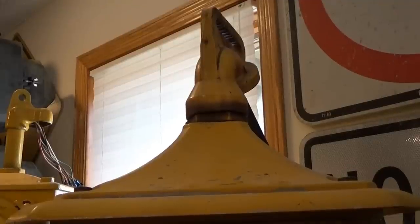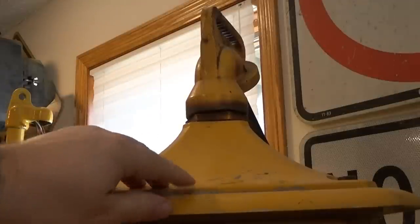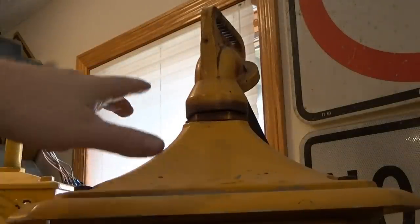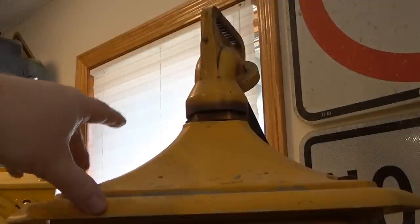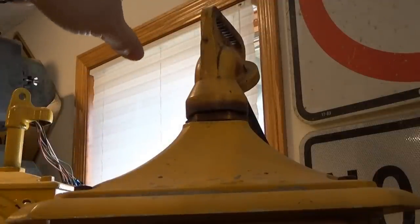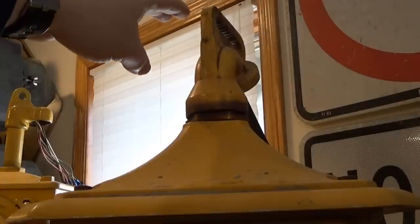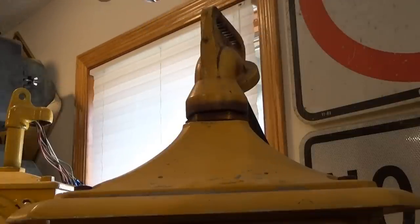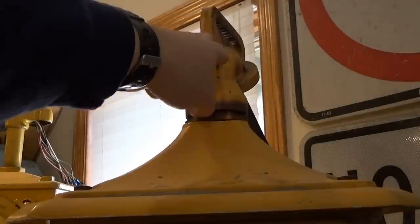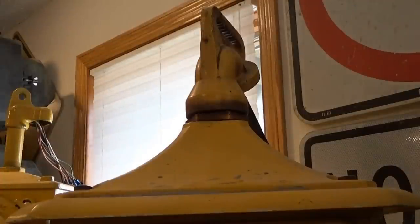The top of the signal is distinct only to Eagle — they had this type of ridging with this slope to the top where the pipe fittings are. We have the span wire hanger, which would hang on the wire spanning between the two poles, and then either a balance adjuster or it would connect directly to this wire entrance fitting, and the cable goes inside from here.